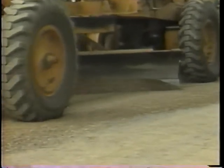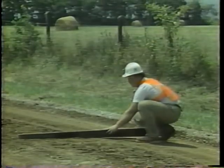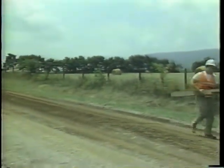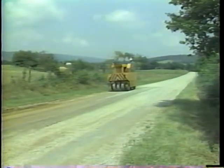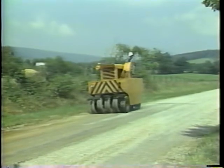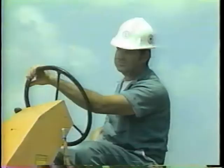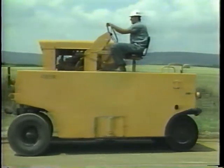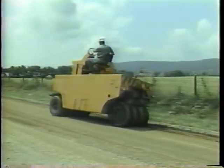If the bubble is not centered, the cross slope is too steep or too flat. To correct the cross slope, blade and spread the material again. The proper cross slope is very important for good drainage. When you have obtained the proper cross slope, and before you compact the subgrade, use the water truck to add moisture if the subgrade becomes too dry. Compact the material with a rubber-tired roller by starting at the edge of the road, then overlapping each pass one-third the width of the roller as you move toward the center. Make several complete passes across the subgrade surface to fully compact it. Do not destroy the crown by making a pass down the center line.